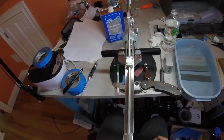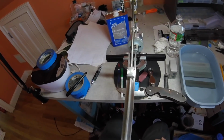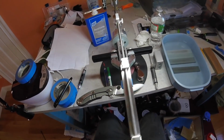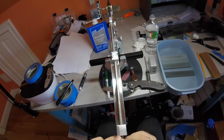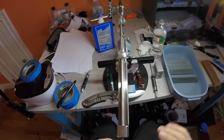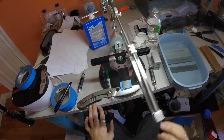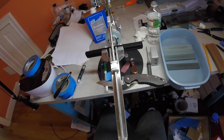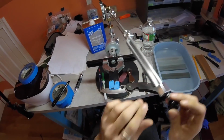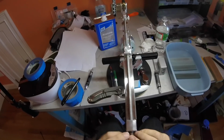Now that you're finished with your stone, we're assuming that you're apexed on both sides. So now we're just finishing your stone. What you're going to want to do is get as much of that burr removed as possible. Keep lightening pressure. Keep reducing the amount of strokes you do. And then when you've done that for a while, when you've gotten to a good place, what I want you to do is just do 1, 2. That's with normal pressure. Do this for, say, 5. Just normal pressure, like, let the weight of the stone. Okay? Weight of the stone.